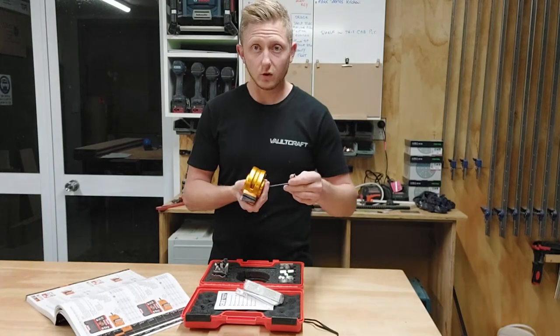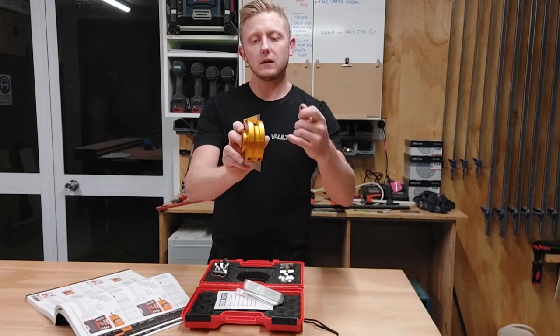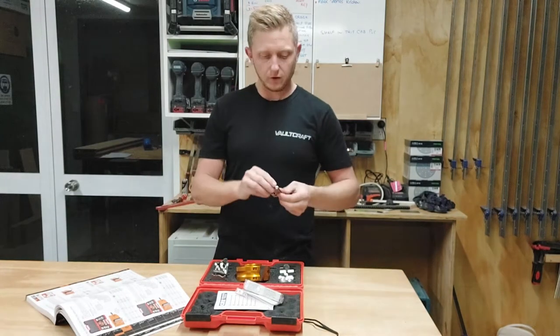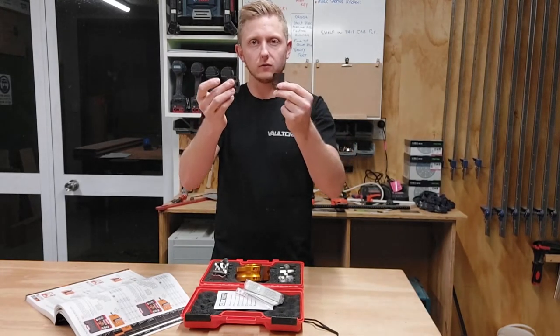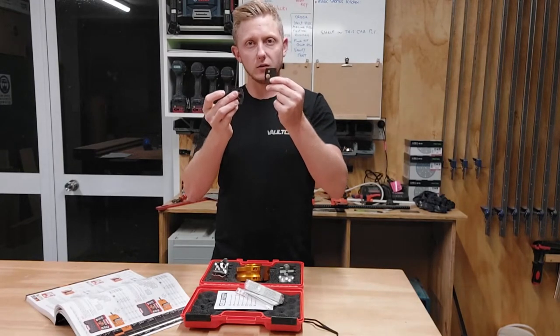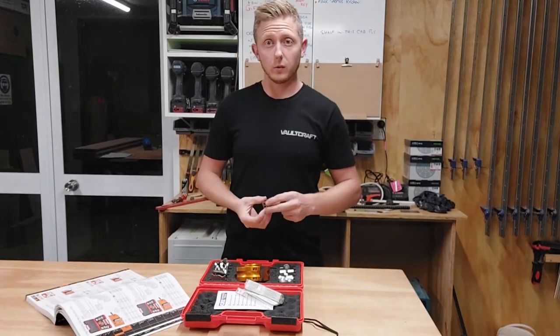It's really easy to change the blades and it's accurate, which is probably the biggest thing I went for. All it is is just the one Allen key — you undo that and all of your knives have got locating lugs, so whenever you put any knife in either side of the cutter head they all go in the exact same alignment and you're never worried about which one's cutting more than the other or your profile being mixed up.